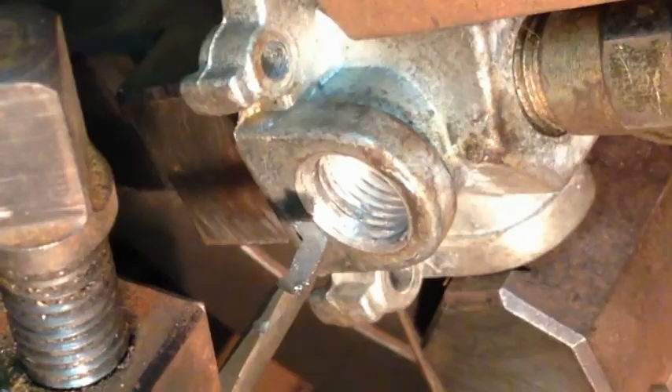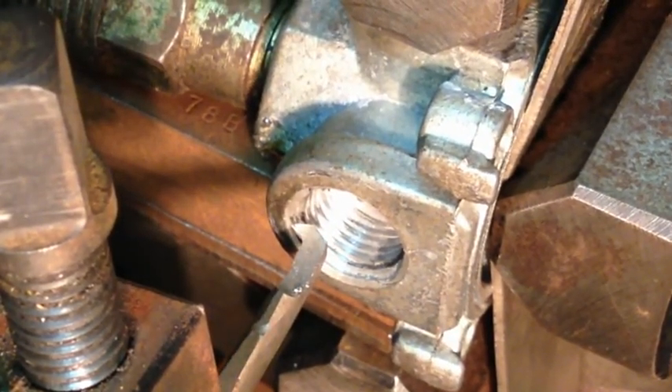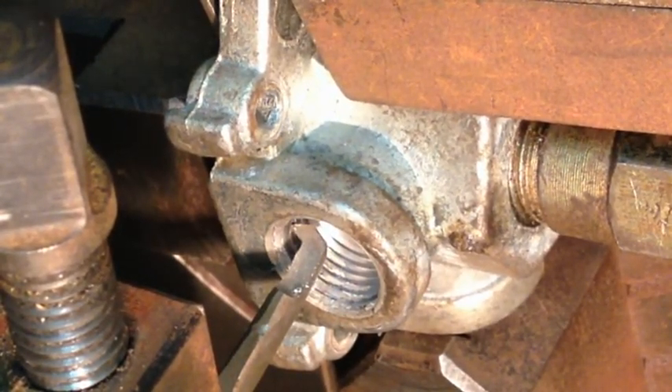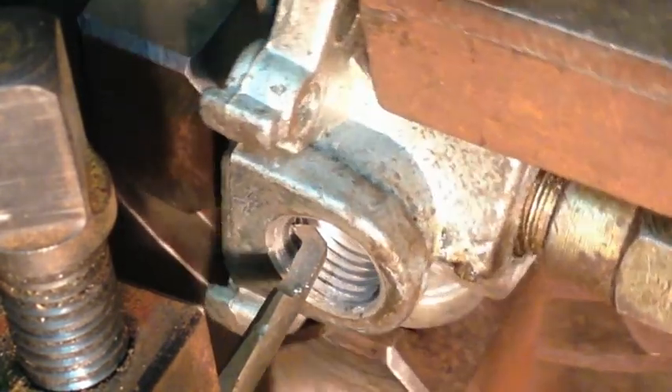Just by hand I've been winding the chuck while I've got my little threading tool in, just winding it in to pick up the threads. Since it's pretty much a blind hole, I've just been going backwards and forwards, increasing the depth each time.